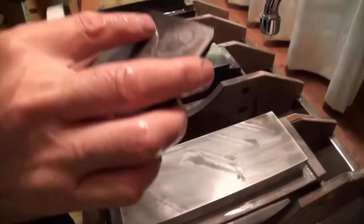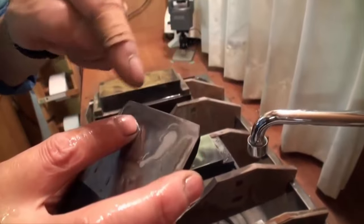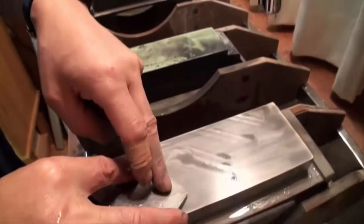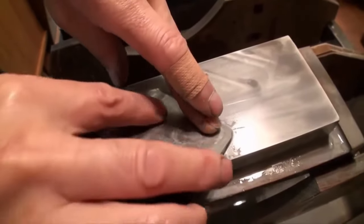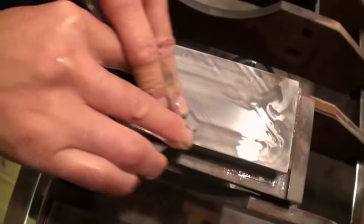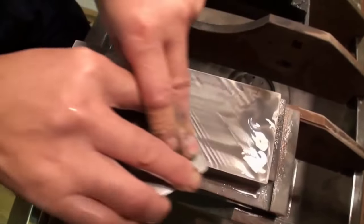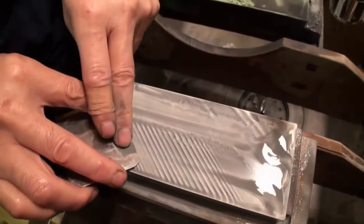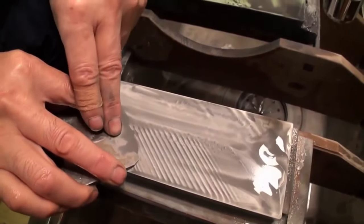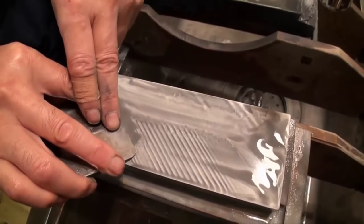During the sharpening process, the way the blade is held is extremely important. The plane blade is held in the palm of the right hand with the index finger extended. Place the first three or four fingers of your left hand, depending on the size of the blade, in the space created by the right thumb and index finger. Your fingers will maintain pressure on the blade to keep the bevel steady. The left thumb, placed under the blade, will provide support for the back.